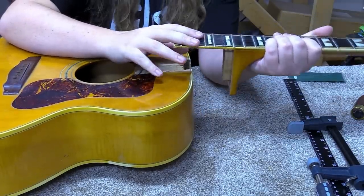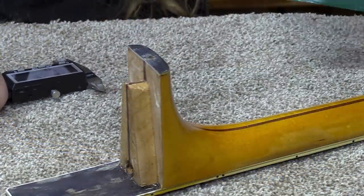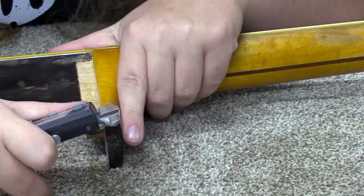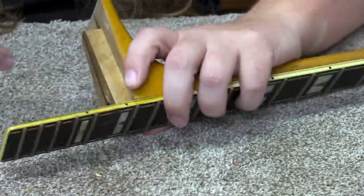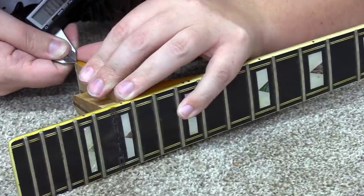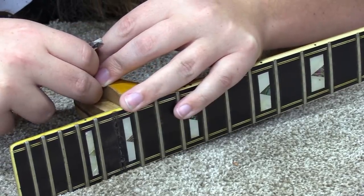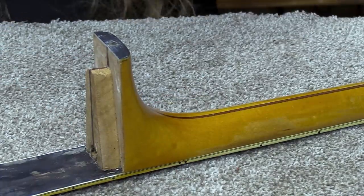Taking the neck back out of the pocket and setting the guitar aside to look at the heel. This isn't going to take a whole lot — I'm going to start with 25 thousandths of an inch, taking off this edge down to nothing at the front. I think that's going to put me plenty good. Now the goal is to carve a perfectly straight line from that mark all the way down to there with my chisel.